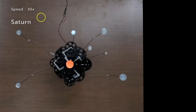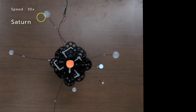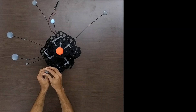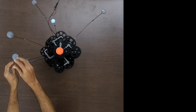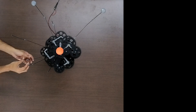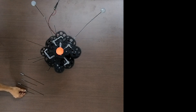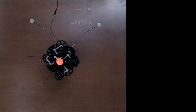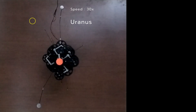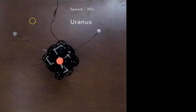The difference between the actual and model numbers is due to the approximate ratios calculated for these planets. This was done keeping in mind the optimum number of gears to be used. The gear tooth counts used are: 33, 27, 17, and 13 teeth; 33, 26, 21, 17, 17, and 17; 17, 33, 28, and 18.